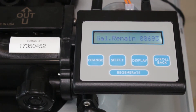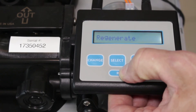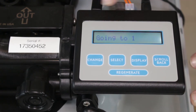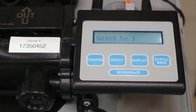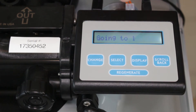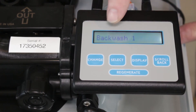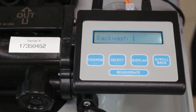Is it currently in a regeneration cycle? I can hold down the button here for five seconds and that's going to start a cycle. You know it's in a regeneration cycle when it's not waffling back and forth between gallons remaining and gallons per minute flow rate. If you see something else on the screen, that means it's currently in a cycle and water should be flowing to drain. If it's doing that at an inconvenient time, make sure the time and regeneration time settings are set correctly. You can see here it says 'backwash' — if this was hooked up to water, there would be water flowing to drain right now, and that's a hundred percent normal.